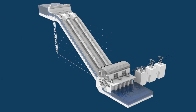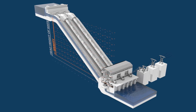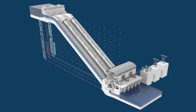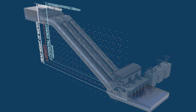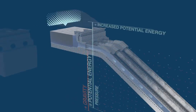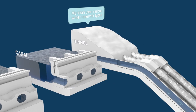Hydro stations combine gravity and water to generate clean, renewable electricity. The height difference between the water level and the turbine creates pressure that is used to spin the turbine and create electricity. Meridian uses various water reservoir types to create a head of water.